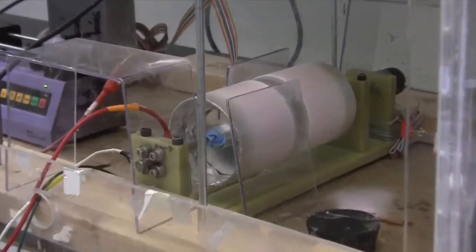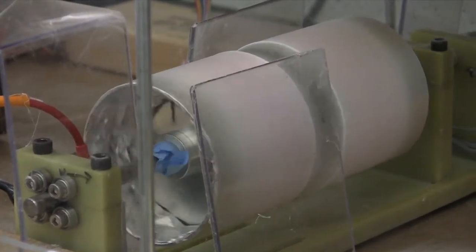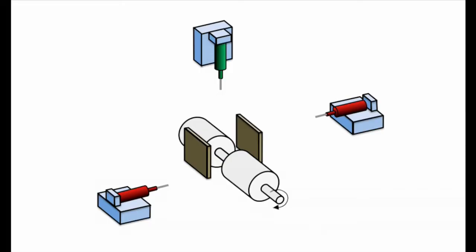The collector consists of two metal drums separated by a gap of 2.5 cm. With the drums rotating very slowly, a polymer solution electrospun into the gap between the drums forms aligned fibers, while two more polymer solutions electrospun from the opposite side onto the drums deposit as randomly oriented fibers. The polymers overlap at the edges of the drums, giving rise to transition regions.